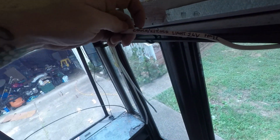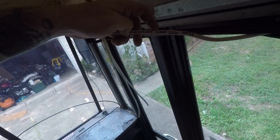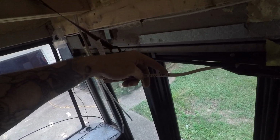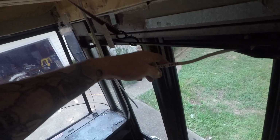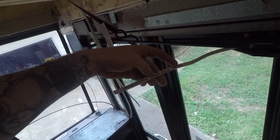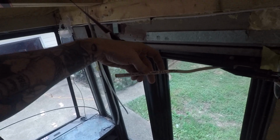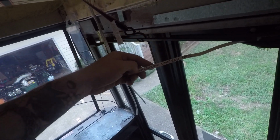And I'm writing on both ends of the cable what it's for. If it says power, that means it's bringing the power for those appliances. And if I put a switch, that means that cable is going from the switch to the light itself. That's how I differentiate between the two types of cables. And I'm putting 24 volts, or 120, so I differentiate between different voltages.